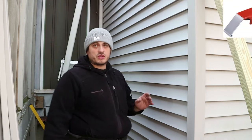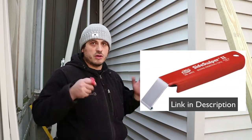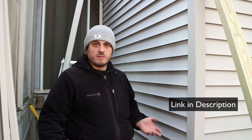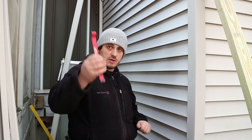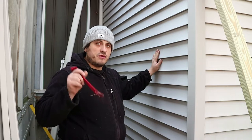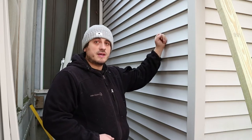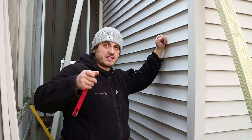When you're removing vinyl siding it's best to use a siding removal tool. However, Home Depot, Lowe's, Ace Hardware and pretty much all local home improvement stores stopped selling siding removal tools. So I can't find mine and I'm gonna use this piece just to unlock my first panel, then it's gonna become easier. But if you're planning to remove vinyl siding I highly recommend getting the hook — I'll put the link in the description below for the best hook that you can get.